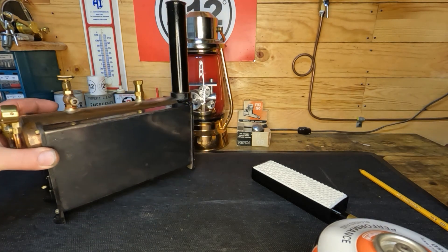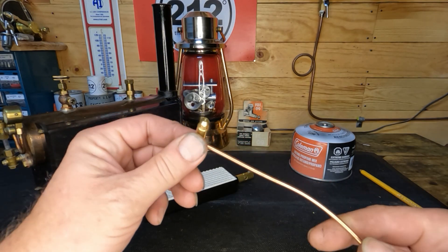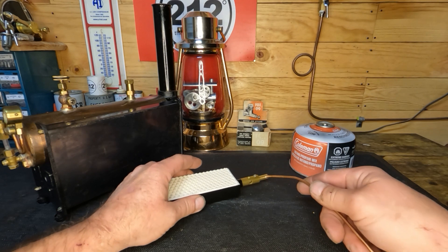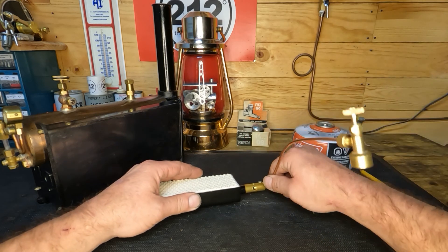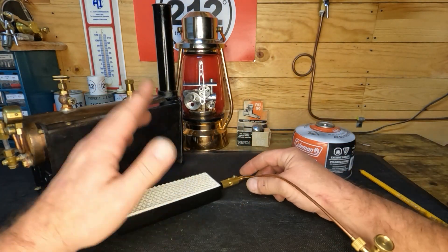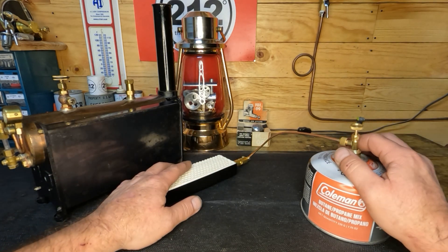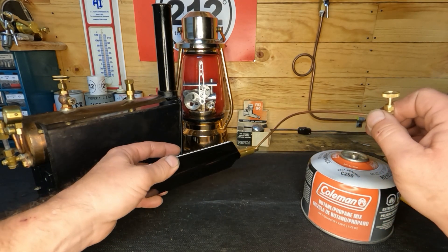With that beam engine out of the way, now we've got a little more room. These have replaceable jets, and this one — I don't know if you guys will be able to see it — but this is a number 16 jet, which is way, way too big for what we're after. We can't adjust our Venturi rate near enough. I mean, this thing's putting out enough gas to heat a double-wide trailer. So let me get this hooked up, we'll light it and you guys can see. As much as I want to keep moving on this project, I've got to wait for a replacement jet.